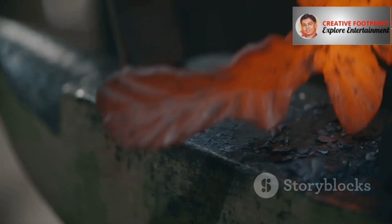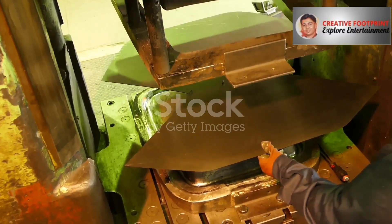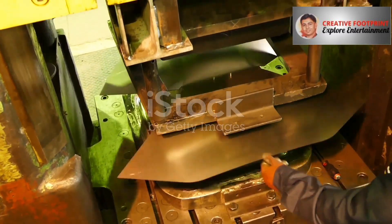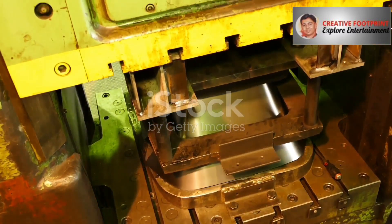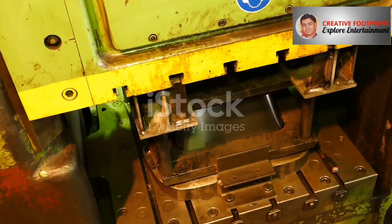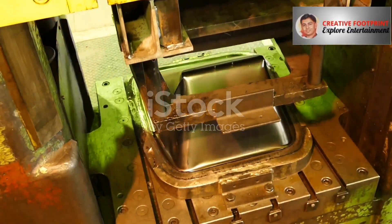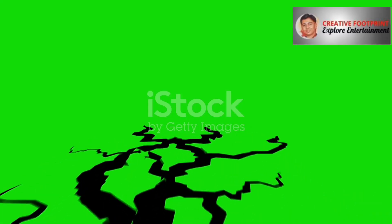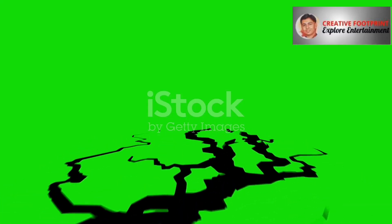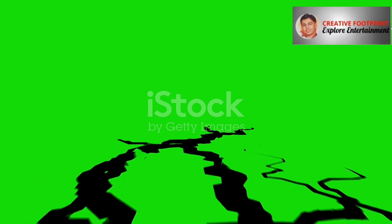This refined directional structure is the secret sauce of forging. A forged steel part can have up to 27% higher tensile strength and 37% higher fatigue strength than a cast equivalent. In almost every head-to-head comparison, a forged part will outperform a cast part. A crack trying to move through a forged part has to fight its way across these tough, elongated grains, making the material far more durable and resistant to catastrophic failure.